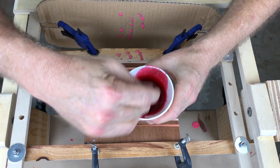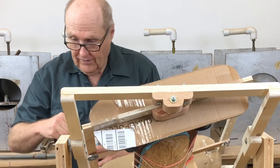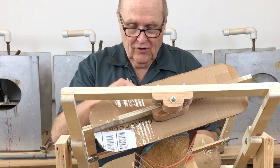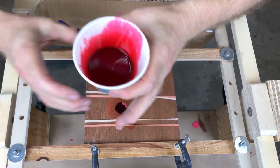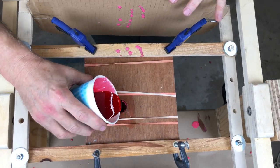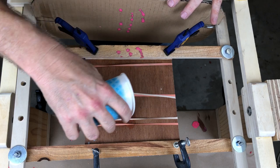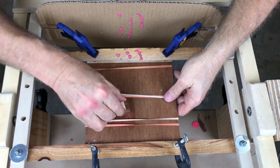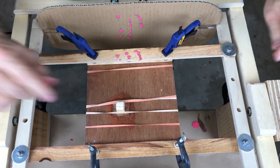Okay, we're going to do the second shot — just exactly the same as the first. Mixing up shot number two. Leaks happen in rotational molding — they're just a fact of life. That's why I cover the machine with cardboard flaps. I call them mud guards, but they're really resin guards. Dump it in — it's getting warm, I can feel it. Pop in the bung. Bung is in nice — put the rubber bands across the bung to hold it down. Let's spin.